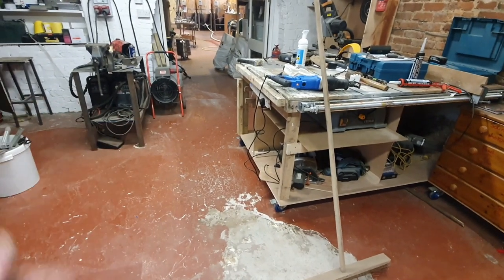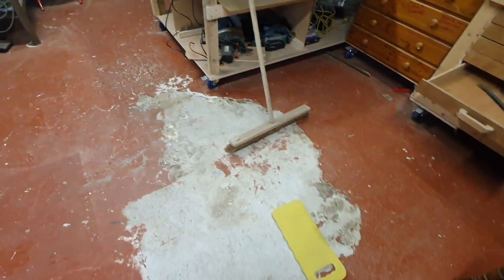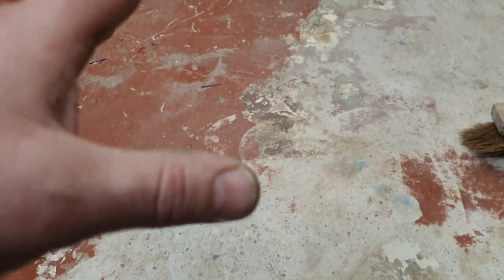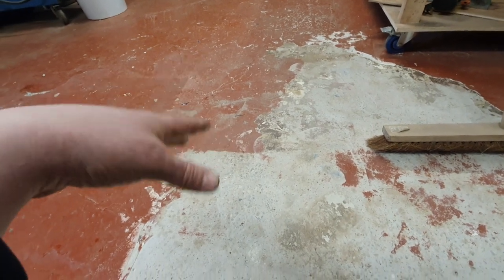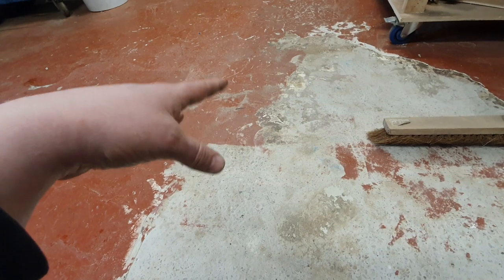We're going to zoom out a little bit today. We've got a wide angle lens on here so we can see exactly what's going on. First thing you're going to see is this great patch of floor where the paint's all missing. If I come down on the level with it and we put a normal camera lens on, you'll see that what we've been doing is prepping the floor to take a polyurethane resin. Now in here, being the workshop, we don't need chemical resistant polyurethane. I thought I'd just do a test in here and we can probably just put normal paint down, but what I'm looking for primarily is good adhesion to the substrate. So we've got a couple of tools that are helping us with it.